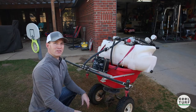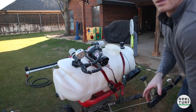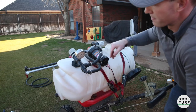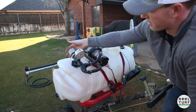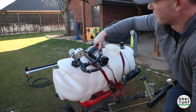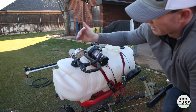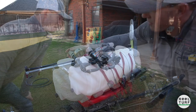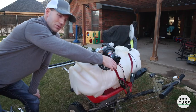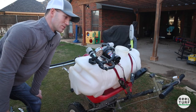It's that simple to replace all these hoses — it just takes a few minutes. Let's run back through our test process and see if we've fixed the issue. Back pressure turned off, ball valve closed, turn the pump on — it's putting up a little bit of pressure. Increase the pressure to 40 psi, we can see that everything's working. Open that backflow valve, increase the pressure here, get it set to 40 — and it's actually holding at 40 psi this time. So we've changed the hoses on the downstream side. I want to go ahead and replace the rest of this system as well because it's old, but that proves we're on the right track.